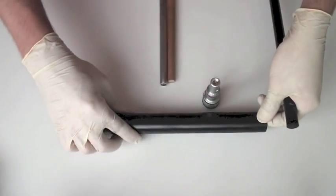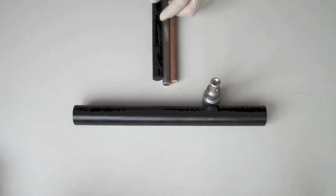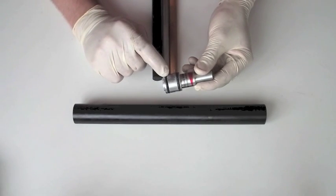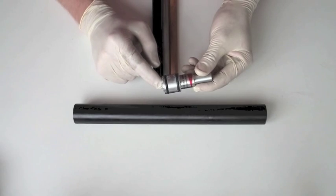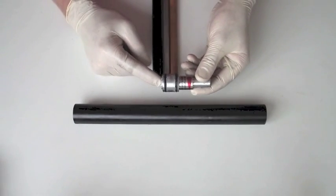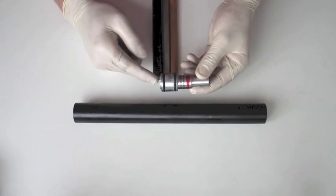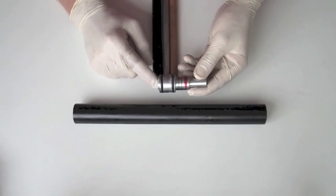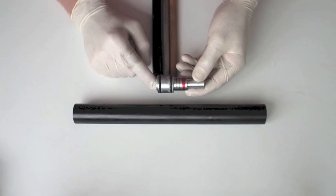If your regulator has been stuck in the cylinder for many years and you think it's due a service, you might find that the O-rings on the case have deteriorated. As covered in the O-ring seals video, these can go hard and sometimes become semi-liquidy, gluing themselves into the metal after many years under high pressure. In that case, pushing it out easily isn't going to work - you'll need to give it a quick tap with a soft mallet on the end of the rod to break the glue seal between the O-ring and the metal. If it was fitted without silicone grease, it could be stuck and will need a tap to get it moving.